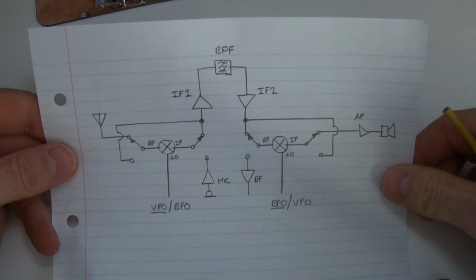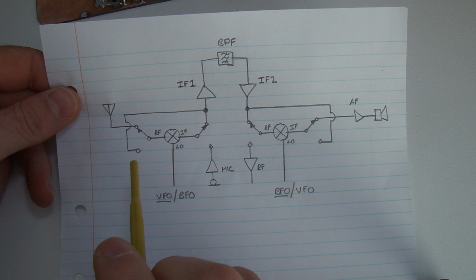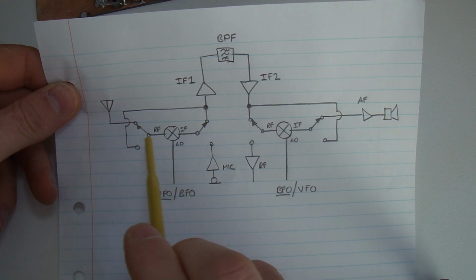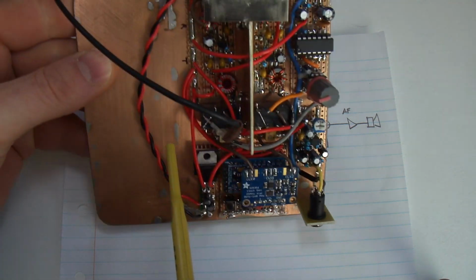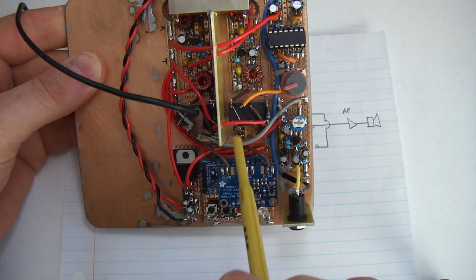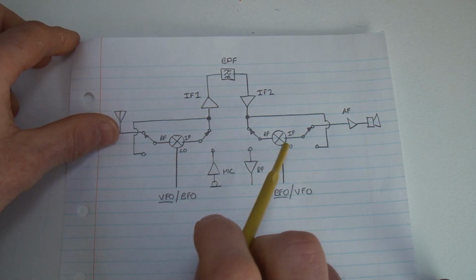So if I was just to pull it away and then bring up this here, hopefully this is not too difficult to read. At the moment, the two black relays you can see down here, let me just go back and point those out again. That's these two black ones here. They are double pole, double throw relays, which are indicated here and here.